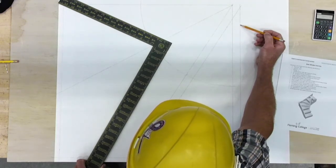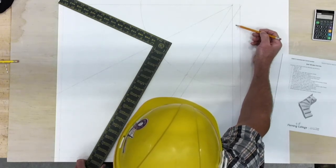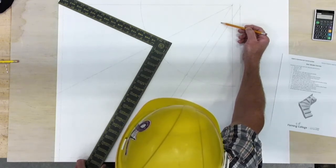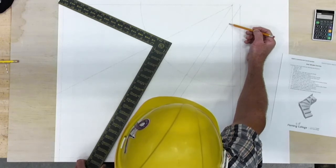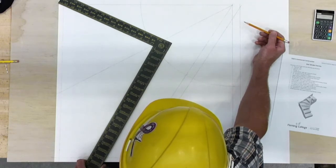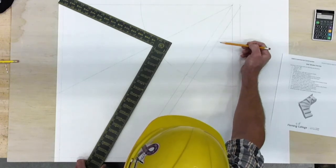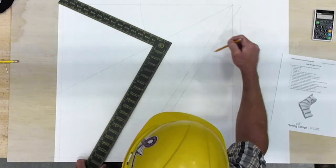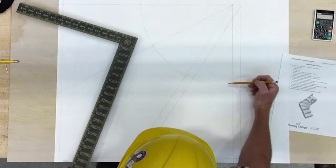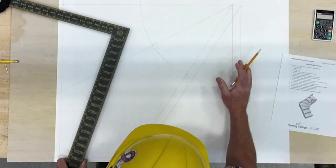If you could look at this, visualize it, there is this much of this winder visible before you hit the front of the next riser right there. So you can see that this nosing at this point extends over top of, it's farther ahead than this nosing right here, which is why we can't have 4-tread winders anymore. It used to be a thing, but we can't because it just gets way too steep. We need to have a minimum amount of run here because this is our line of travel that we'd be walking on. We need space to put your foot on. If I threw a 4th tread in there, you can imagine how tight this becomes.